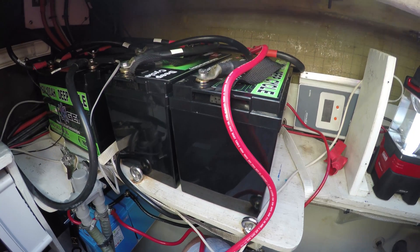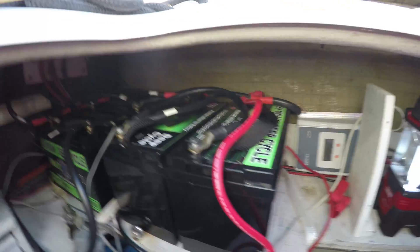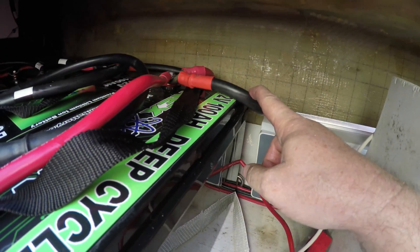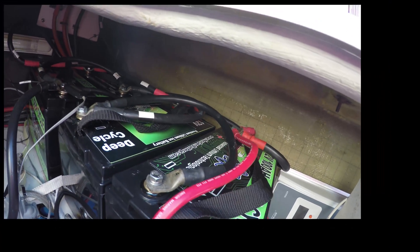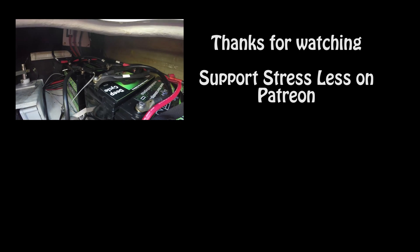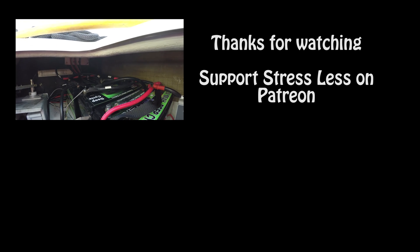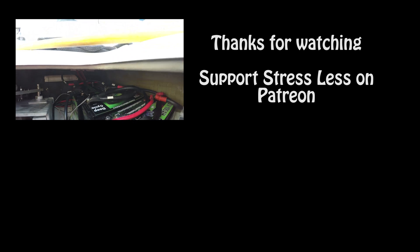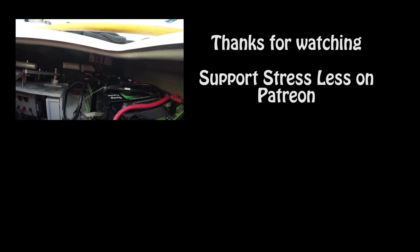Here is the near-final product — got the new batteries in, all wired up. Tried to do it all negatives then all positives. There was a little spark on the last connection on the positive side, but that was expected as the last connection and everything's up and running. I'm going to turn on some breakers and make sure the power works and nothing sparks, then I'll strap down the cables tight, tighten them all up so nothing can move or break free, and tidy up the extra cables.